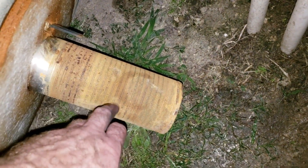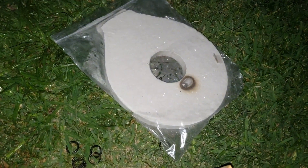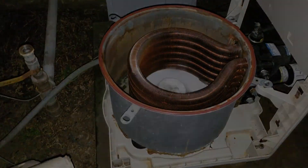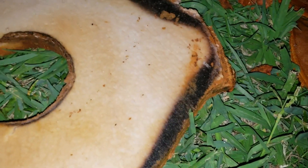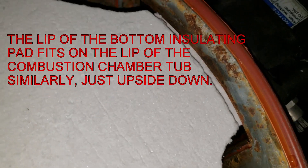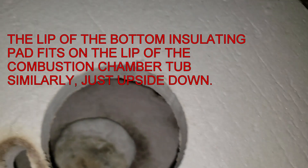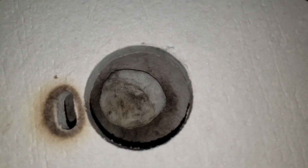I could shut this down for the night and start the next day. I still may do that because I want to see if this needs to be cleaned. There's my igniter. This pad needs to be replaced — I still have that right there, and also the pad that goes on top of that. Here's the old top pad — it goes on top of the coils and was oriented with that little lip on the bottom side. This little lip goes between the top coil and slides underneath the tub's outer rim like that. Now it's perfectly aligned for the cylinder to drop in.